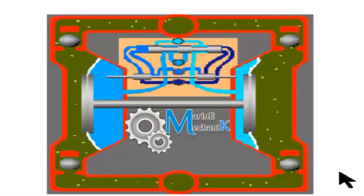Alright, so to proceed further, we have to understand the basic components and parts. Here is the central rod, which houses a plate on either side. In between there is the rubber diaphragm, which is the main component for the pumping action. And here is the suction line, within which the oil or any liquid is sucked into the suction manifold, and then the pumping action happens at these chambers, and then here are the discharge valves. It goes to the discharge line. So that's the simple arrangement.